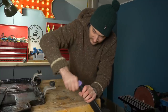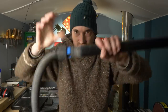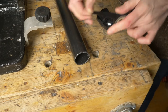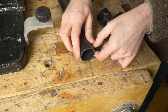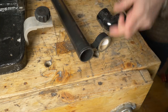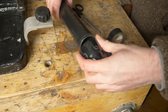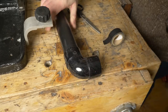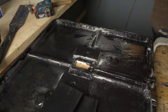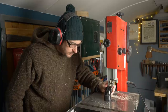I then give the cut a little clean up with some sandpaper. One of my CTX hose fittings fits perfectly in the end of the pipe. I had ordered push fit fittings, but they delivered solvent weld and I don't want to weld them together so that I have the option to take it apart in the future. So I'm just going to wrap some electrical tape round and then they're pushed together with a nice friction fit. For this elbow to actually go over the blade, it's going to need a slit cut in it. I'm going to do that on my smaller bandsaw with a higher teeth per inch count.